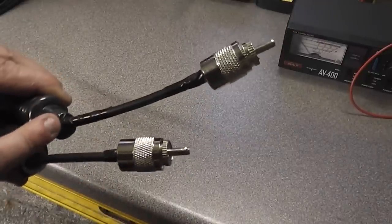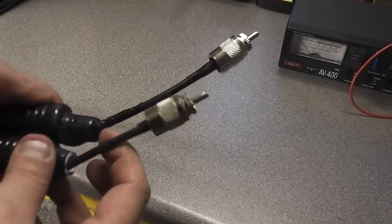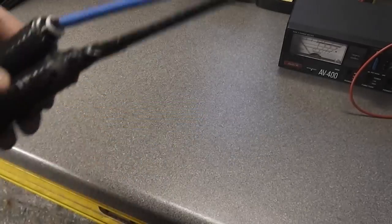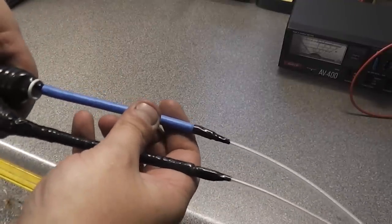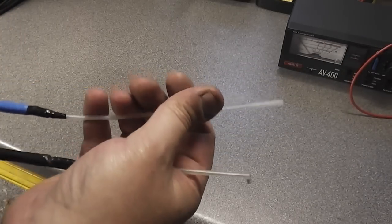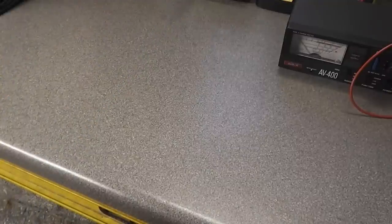You can see I've used tape on the prototype — I never intended to make a second one but with so much interest, why not? Not very much coax needed and who knows, one lucky viewer might end up with the second one in their bag. There are the baluns side by side, the two folded-over portions — one's been SWR-tuned and trimmed, one hasn't, so they're slightly different lengths.